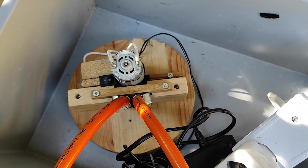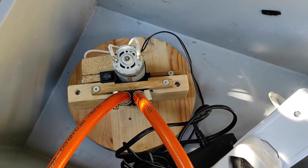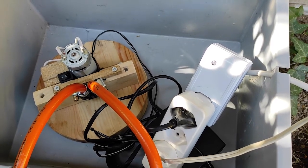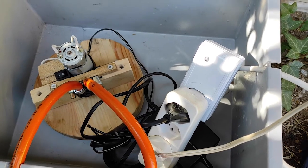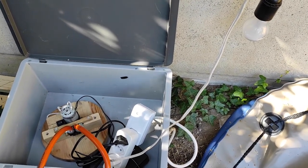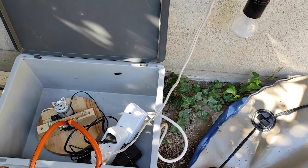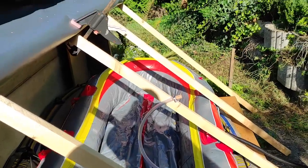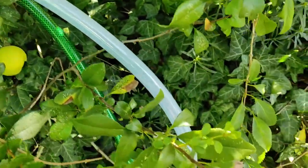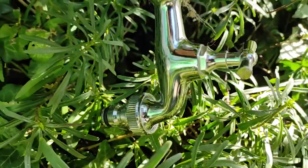Here is the pump with which I pump the gas up from the garden to my kitchen on the second floor. It is controlled via a switch which I can operate electronically, and to see whether the pump is working I have an indicator lamp — I switch it on and the light goes on, so I can see from upstairs that the pump is working. To drain the system of excess water that builds up, I have a hose which runs below the system into the garden so I can let the water out.